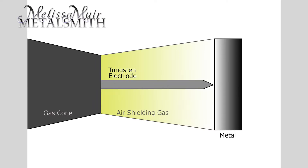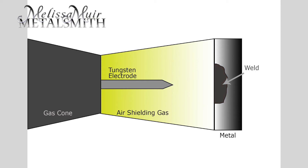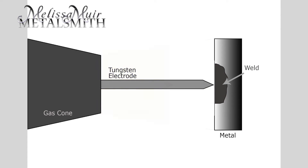As that piece of metal that has been grounded touches the electrode, we create the electrical circuit, which then triggers the system to release the gas — the argon. After you've touched the metal, very quickly that electrode is going to retract, send the energy, creating that little plasma burst, and the gas continues to flow until that burst finishes. Once that burst finishes, the gas turns off and the electrode will come back down.